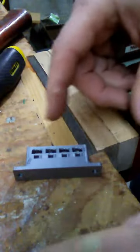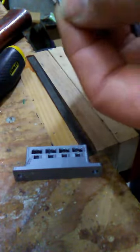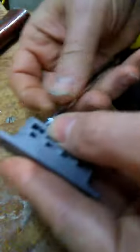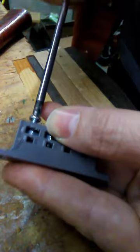My homemade terminal block — get yourself some M4 nuts for this particular model that I've designed. Sometimes they're a little tight fit. Unfortunately, M4 nuts come in different outer sizes, so I don't know if the ones you have will fit this file, but I hope they will. A number eight screw fits in this hole just fine too, but for some reason the different sized nuts won't fit, so I just screw it down and get ready for the terminal there.